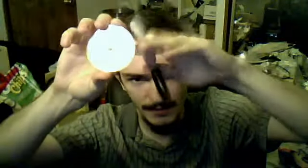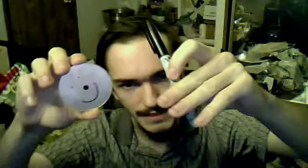It's surprising how easy you can make these circuit boards. This one I cut with a drill press and used a photo resist board. They sell these markers really expensive at places like Fry's Electronics, but this is just a Sharpie. You can get a regular Sharpie and mark up wherever, like where this smiley face is on this board — the copper will stay if you use an etch solution. So that's a tip for those people making circuit boards out there.